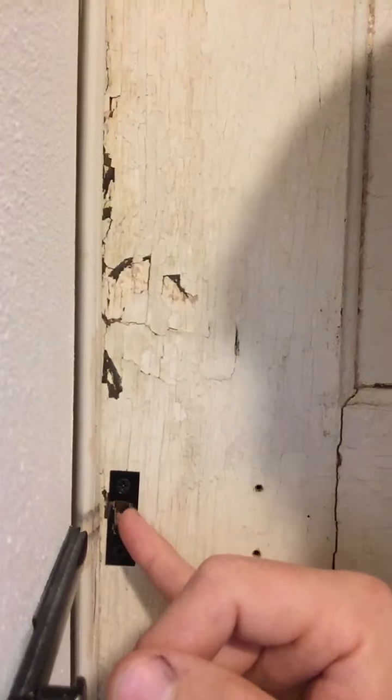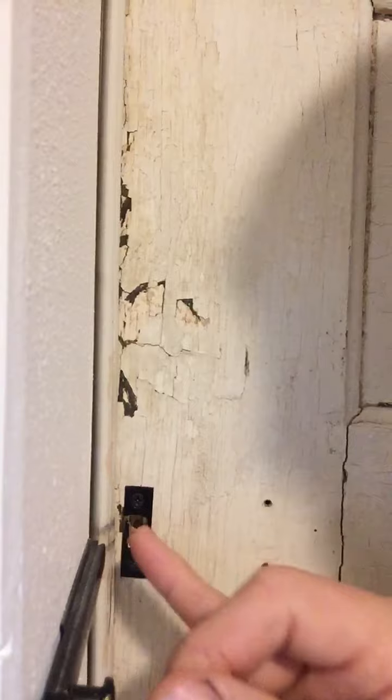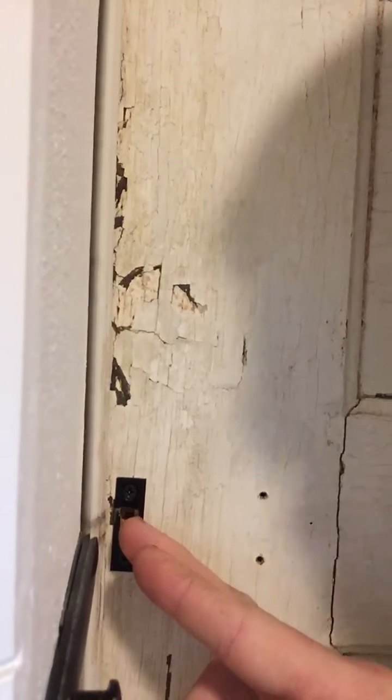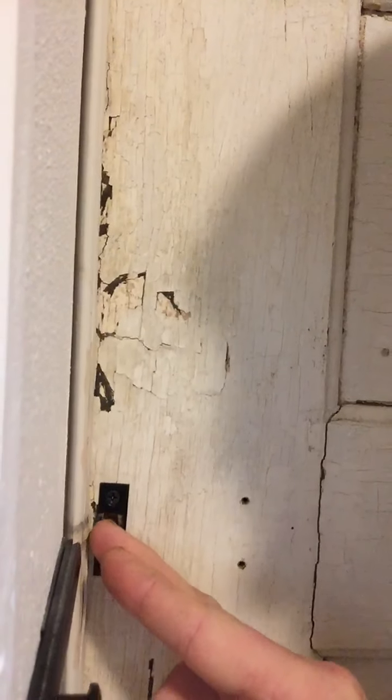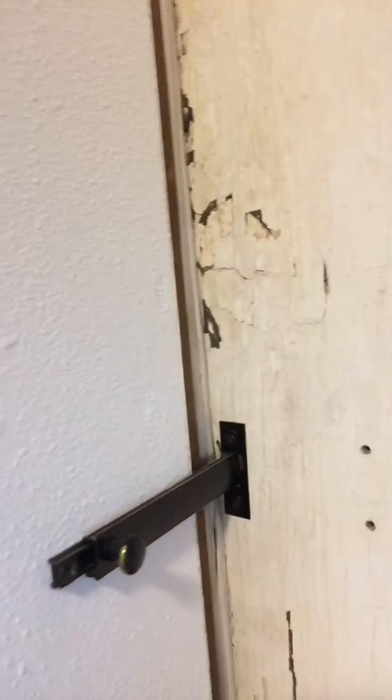I took a pencil and marked out that little cutaway that the bolt is going to pass into. Then I took an end mill or a little router bit and chucked it up in a drill, and I made a pocket in this door so that this bolt will go into this door quite a bit. That way I wanted to make sure that there was no chance of the door coming open when somebody locked the door.